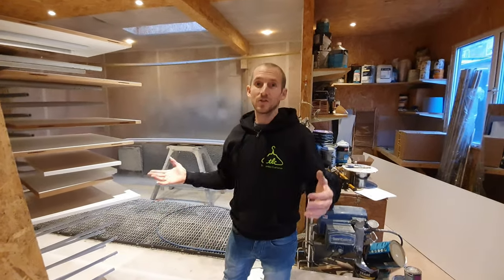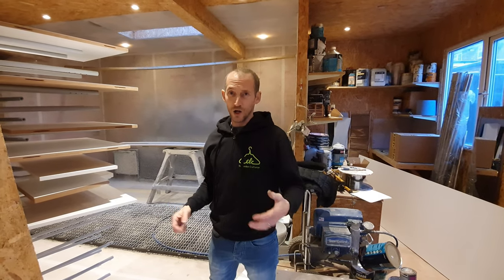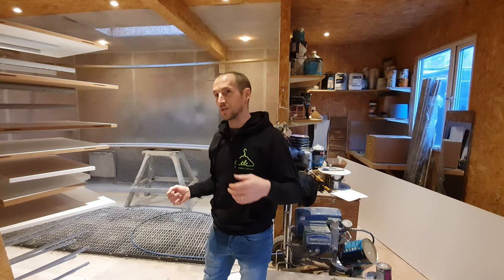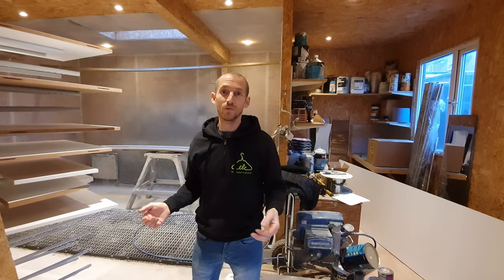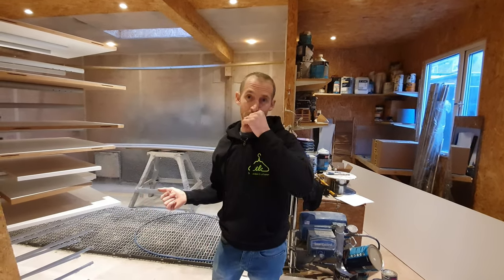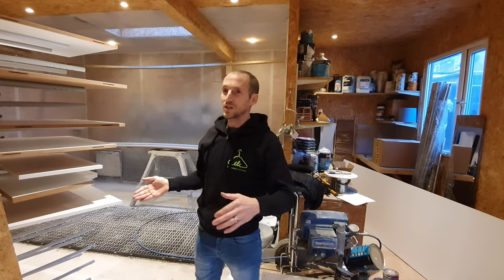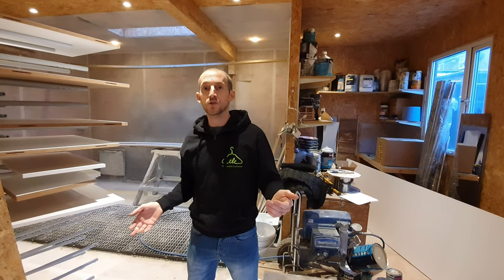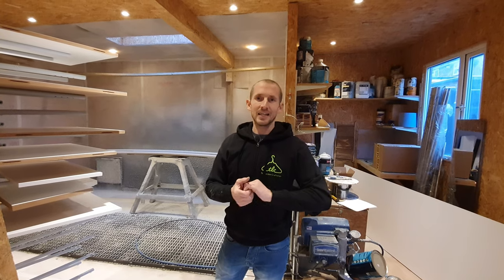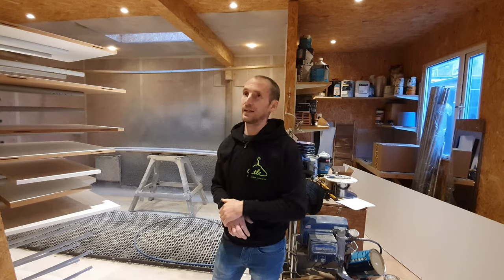So all these bulbs that we do have are GU10 fittings, and they are quite a common fitting. They fit in most downlighters. They are fire rated, because back in the day we did have halogens in them, which, you know, get quite warm. We don't want to get that space warm and have a danger. So we did have fire rated downlighters, but they're all LED now, just to reduce power consumption, give us a better overall light. Technology and LEDs have come a long way over the past 10, 15 years, and the quality of the light is so much better than they were.